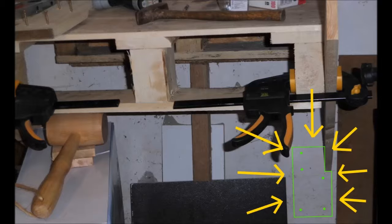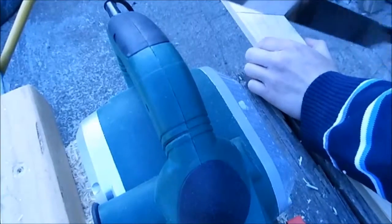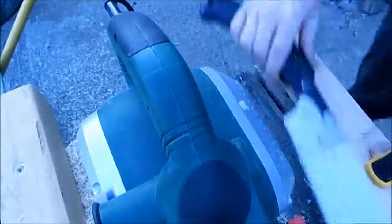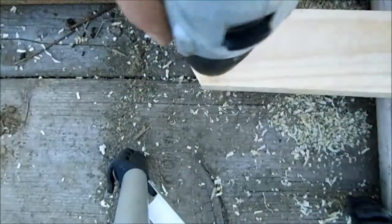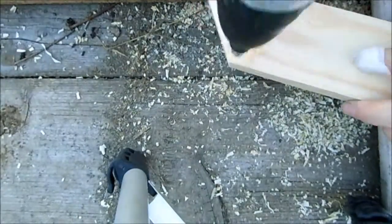After drilling holes in the wall and putting in what we call a dowel — I don't have the right translation at hand — I screwed the brackets to the wall. Well this one at least, the other one will be done right after. But before that, I quickly marked the length of the brace and then cut it off, drilling a few holes. That way I can mount the brace before doing the other bracket so the whole assembly doesn't cave in on me. I had to get my lace out of the way to screw the braces in but then I had enough room.